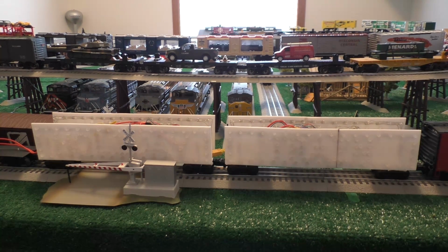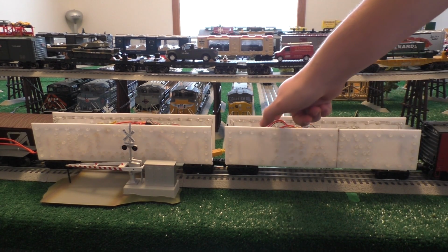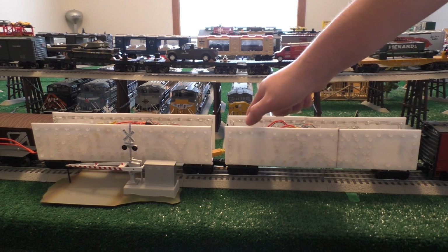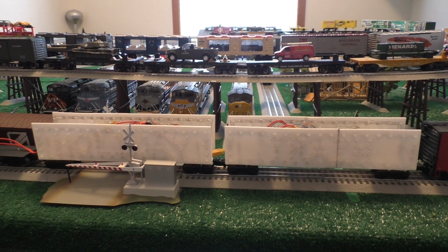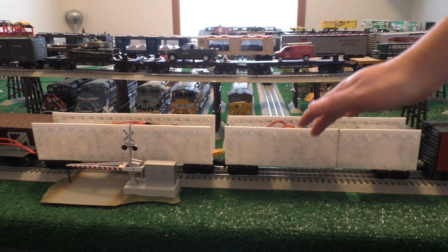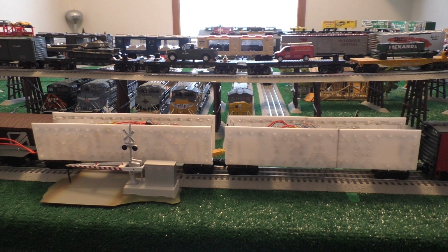One thing I am kind of concerned about is the reliability of these things. The solder joints don't seem to be all that great on a lot of them. It seems like they kind of pop off. I didn't do too great of a job doing all the soldering work. And also, with as close as these pins are together, it doesn't take much for them to wiggle and actually short out, and then you're missing a color once that happens, or maybe the blue and green get shorted together so you don't have different colors for blue and green, you kind of have a cyan color. So there's been some odd things going on here, but right now they work.